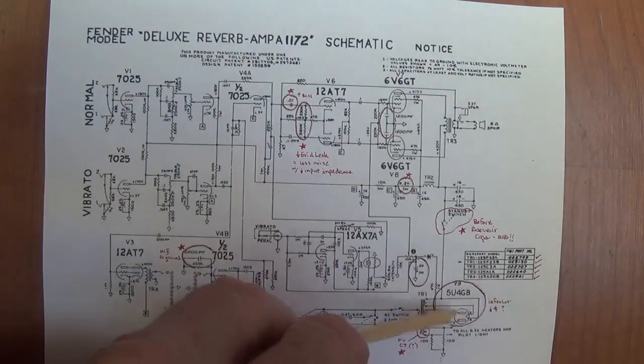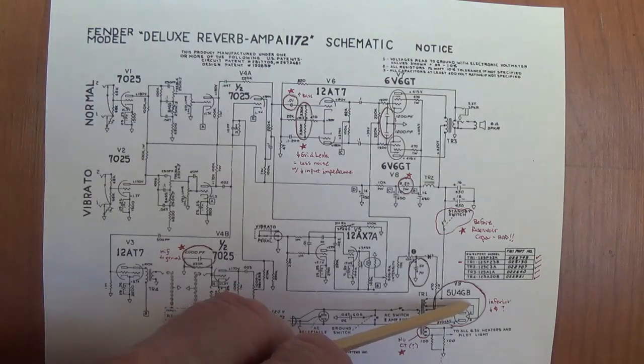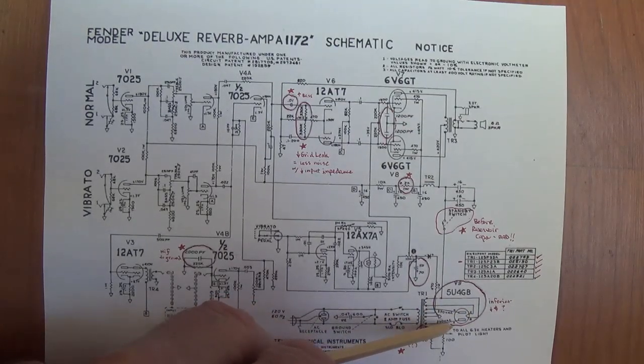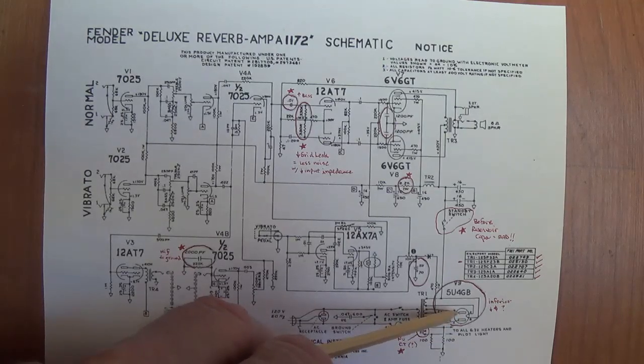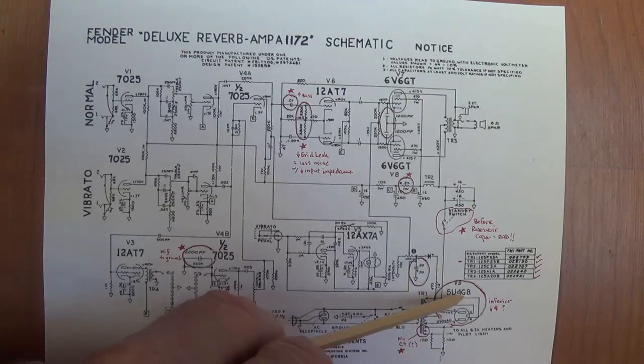Also, all of the Silverface circuits after the AB-763, including that AB-868, all use the inferior 5U4 rectifier tube, and it's got to be a CBS decision to reduce manufacturing costs. They must have gotten these cheaper. GZ34s are kind of a deluxe rectifier tube and are probably more expensive. This is a bad move.